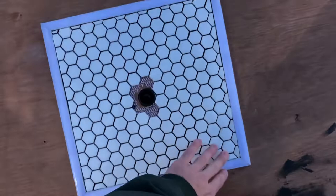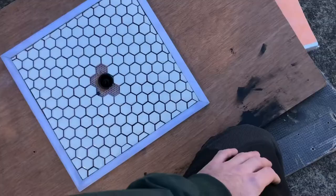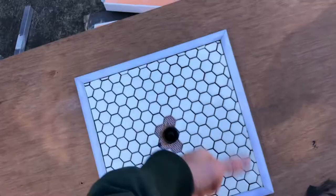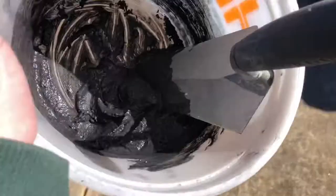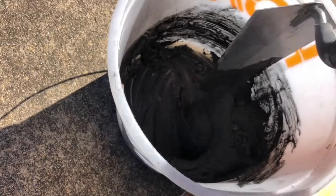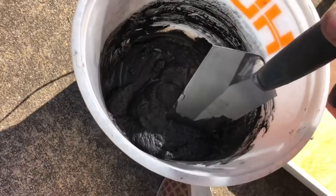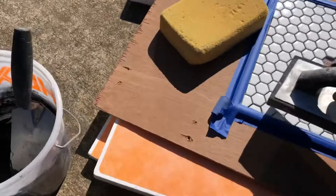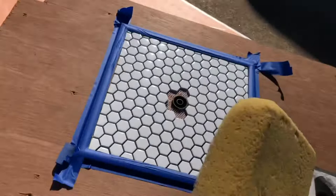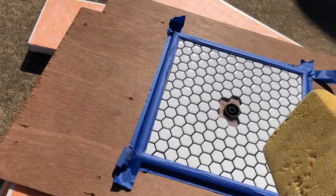And I didn't tile the rest of it — I'm going to have to do that upside down because I had to attach it with these screws to my actual ceiling. And I just used silicone to attach this tile because it was going to be hard getting mortar in there and then squeezing out and messing up my clean lines. So now I'm going to permanently install my ceiling. Actually, I think I'm going to grout this before I put my shower back on it. So I'm going to tape up my LED strips and just get this finished to then install it. I just mixed up a little grout, a little charcoal color. You don't want it too runny — this is borderline a little too runny — but you want to trowel it in and then use a grout float and push it into all the little joints.